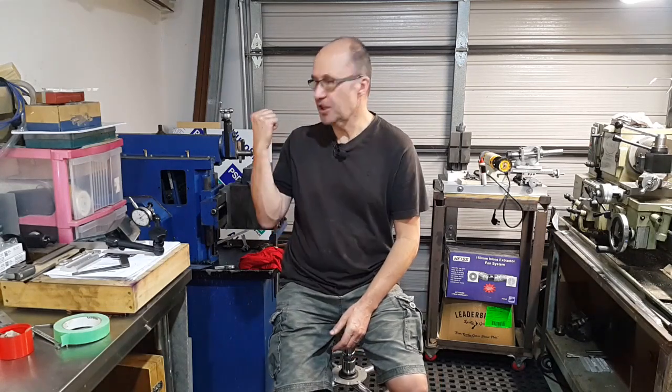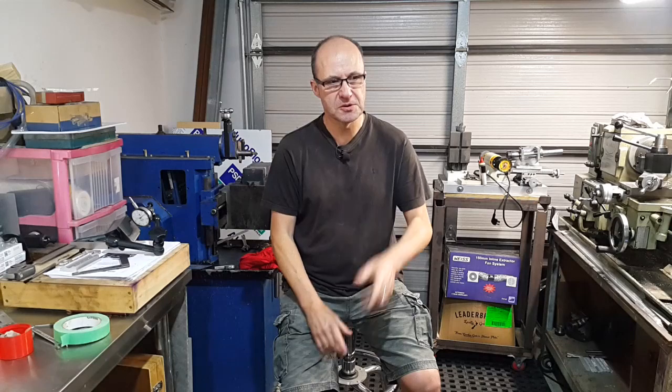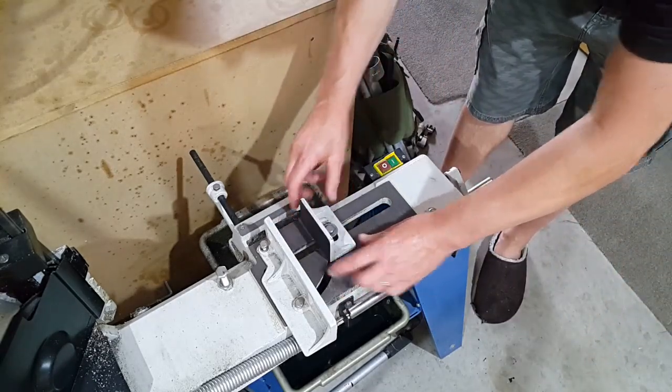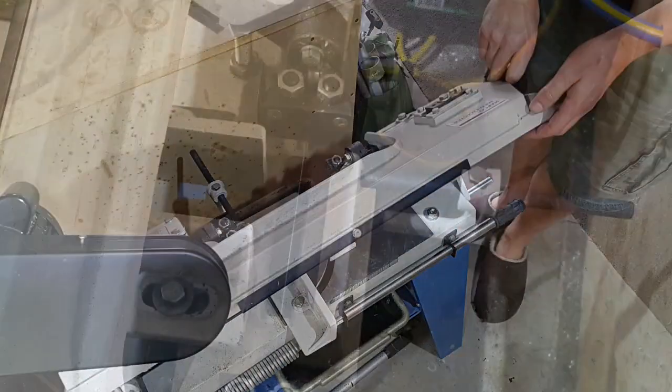What I'm going to do first is take the jaws off that are on there now. I'm going to cut them on the shaper and just skim them, because at the moment they've got some quite bad machining marks in there. Also they're not perfectly square, so I want to square them up as well, which has been another issue in the past with cutting some pieces. So we'll have a look at the jaws, see what sort of state they're in, and then get them on the shaper. This jaw here moves in and out on a screw which tightens the metal in here, and if I bring the saw down you'll see how bad that is.